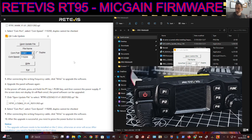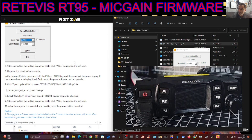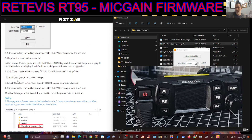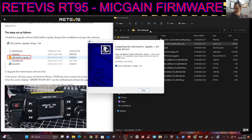Once you've done that, hold down this time the P1 button - which is the one above - and the push button again. Turn on the power supply, and then this time you're going to select the other SPI file, which is the LCD one. Run that, and at the end of that the radio just turns on. Watch the rest of the video first.